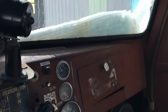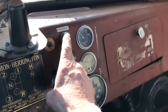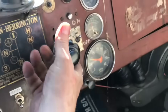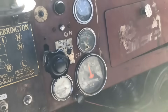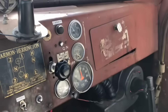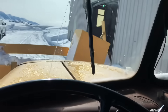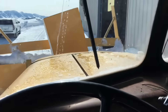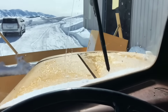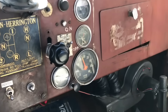Turn that engine off. Now the rear engine — you have to turn on the battery, lock in the override for the oil pressure, and then hit the start button. Because it's warm, it starts real well. To get throttle out of that, you turn this knob to the left. Eventually you'll see the RPMs increase on the engine. I run this engine somewhere between 2000 and 2500 RPM. With the engine running, you can move the snow direction so that if you're in the wind or you want to put it on the left or right side of the road, you can — and you can raise and lower the auger. To slow it down, you just push that center button and it drops the RPMs back down to an idle. Then turn off the engine right there.